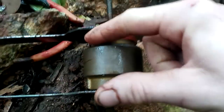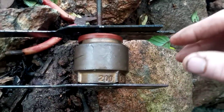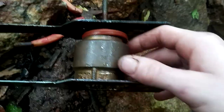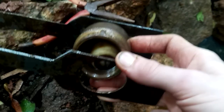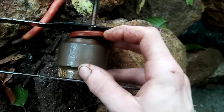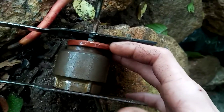This foot valve — I cut off the brass bracket. There was an A-frame bracket on top that I cut off because you don't need it. The bottom is all stock, everything is threaded still. I didn't mess with the inside, the internals at all, the valve seat or anything. On the inside of this, I made my valve out of an old skateboard wheel. I'm not worried about it being food-grade because this is creek water I'm pumping. I also have some kind of a rubber flat plate — a gasket I found in the garage.